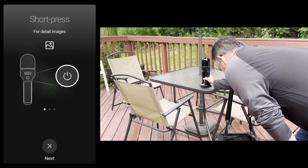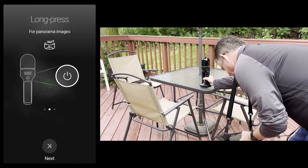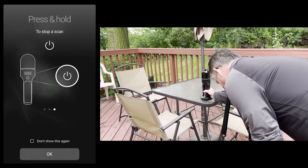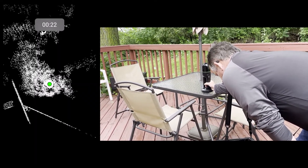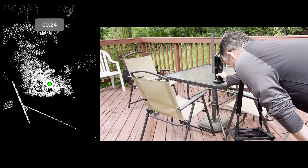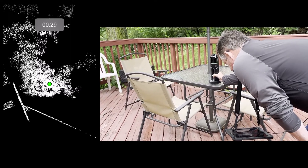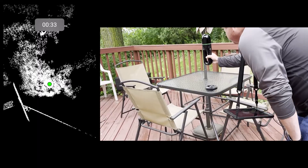We use the term of a walk instead of a scan with a mobile scanner. There is a weighted base that we start and end our walks on and it's very important that this does not move. After starting the walk, I need to let the BLK2Go map the starting area well by allowing it to collect data for approximately 30 seconds while I hold it. At this point, I can lift it up and start walking. The day that I collected this data was extremely windy, so I've turned the recorded audio off.